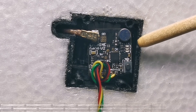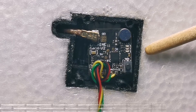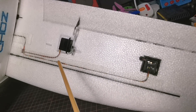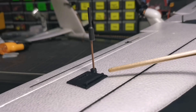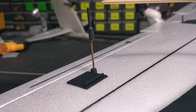There are 3 LEDs on the side: red for power, blue for channel, and green for frequency. For the range test, I'm going to test this on all power levels to see how far it can go. I mount the VTX on the wing like this, far away from other electronics to minimize interference. There is an air inlet on the 3D printed parts for ventilation, and we are going to use the stock antenna for the test.